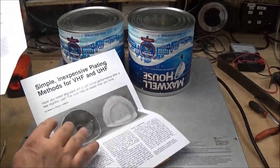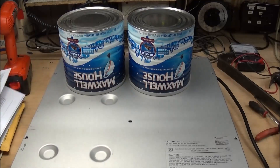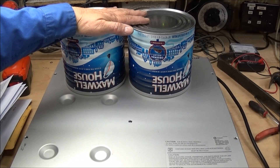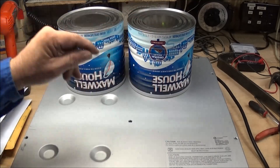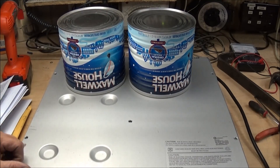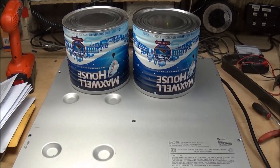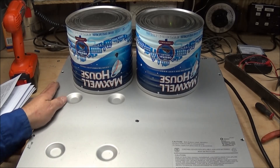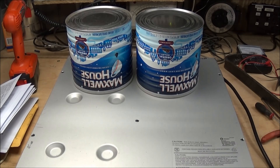The UHF is going to be completely different. You might wonder how you can build a UHF duplexer in coffee cans - well, you can, but you have to remember that duplexers are temperature sensitive. If you build one in coffee cans and tune it at 70 degrees Fahrenheit, it's going to have to stay at 70 degrees Fahrenheit or your tuning will be different. So you have to use these in a controlled environment. There will be four cans - we'll go through it and explain how it works. Anyway, that's about it for this video - if you enjoy it, give it a thumbs up and we'll see you next time.